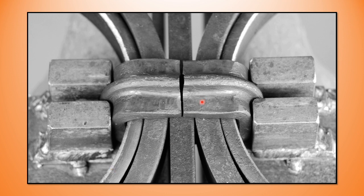With my purpose-built set hammer, I can come along here, I can just pop that on, just lift up the corner a little bit because I've got soft corners, remember, and I can just scooch this material out and I can close this top portion of the collar. I'm not going to be able to get to the root, but that's okay. I can just close this top portion of the collar so it's visually a little more attractive.